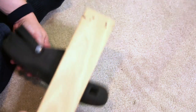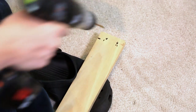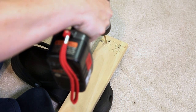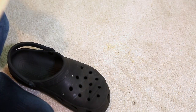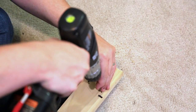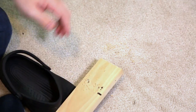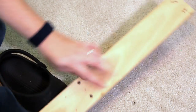I'm using my makeshift sawhorse, which is one of my Crocs, because I don't want to keep running back to the garage every time I need to drill a hole. So we're actually doing this in the man cave. Okay, there's one, there's two — we'll just dump the shavings on the floor and let the Roomba deal with that later. We've got two more. I actually marked that one wrong — the inside one is the right one. One more. And then I'm going to drill pilots for my two big guys so that I can run the bolts through the board without it splitting.